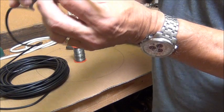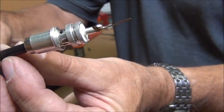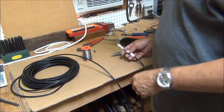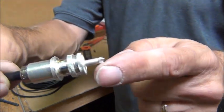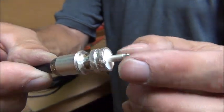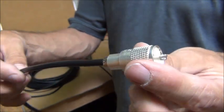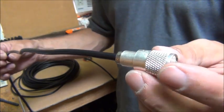I've finished up soldering those holes and it's still a little hot. I'm going to cool it down, then clip off and clean up the tip here — it's got a little extra solder there. I've clipped off the excess wire and cleaned up that connection, so the excess solder is scraped or cut off so it'll plug in nicely. So that one's finished. Put the outer case on there and it's ready to attach. I have to do that three more times — I'll cut these cables to length and attach three more PL-259s and then we'll be ready to hook these up.